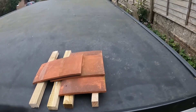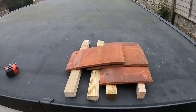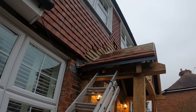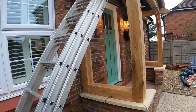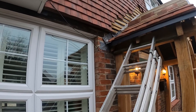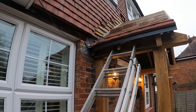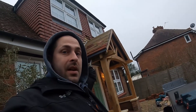It also gives the angle which the bigger tiles will create once they've been laid out. I started a little bit already. I used lead flashings to start, for a couple of reasons — the ally flashings are too shiny. But once I get above the area where the wall is tiled, I'll carry on with the ally flashings because no one's going to see them. So yeah, that's basically that.